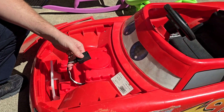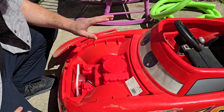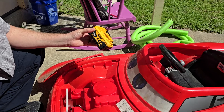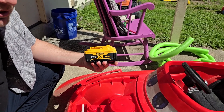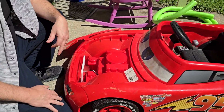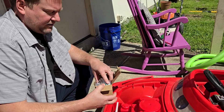Power Wheels are either going to be 12 volt or 6 volt. I figured let's do one better — let's convert it over to lithium. We're going to use a 6 amp hour battery, and this could be 20 volt, which should mean that this car is going to go faster. They sell these kits — I will leave a link in the video description below.